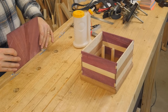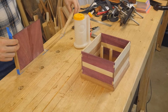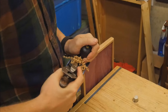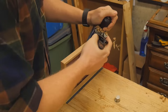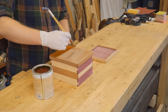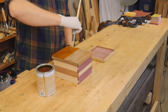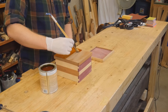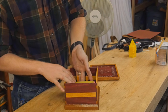Use the tape trick to glue them all together — just a piece of tape at each of the four corners holds them together so you don't have to clamp them as much. Put the top end of the groove, put the whole thing up, tape it in place, and then make sure it is square and fits the box appropriately, and you get yourself a nice shape. As with the bottom, I wanted to give the top a really solid chamfer, so I can skew the plane and cut that in all the way around. Used a shellac finish — on this particular piece, on my box, I like to use shellac. It just gives it a little bit more hearty finish than the paste wax. Put in all the cards and give it to her. I hope she likes it.